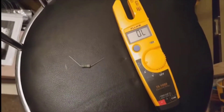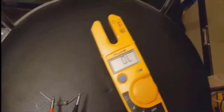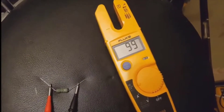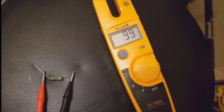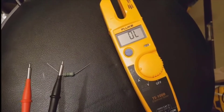So now I'm going to show you how to test the resistor. It will test up to one K max. So we put it on the ohm symbol on the tester and we put the probes on, and there we go. We can see that says 99. This is an actual 100 ohm resistor. So we expect a little bit of play in this resistor, but there you go. That's how you test a resistor.